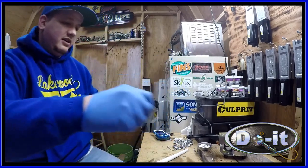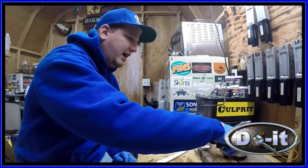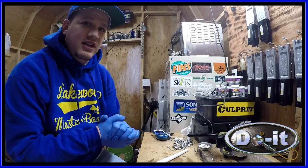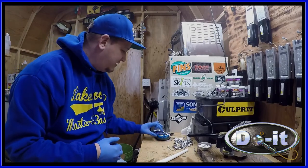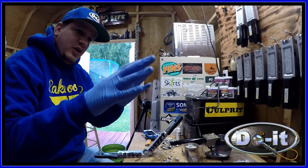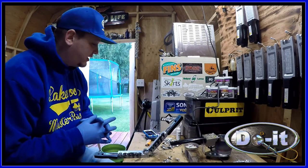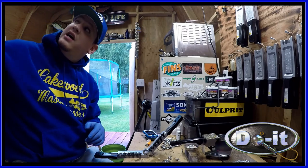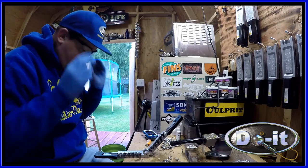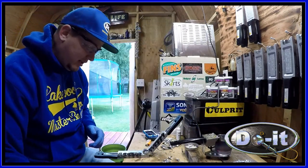All right. So then I keep the mold on the pot here because you want to make sure that the mold stays hot at all times. All right, let's do this. Okay, so we're ready to pour. If you notice, I have my gloves on. Whenever I'm touching lead, I always have my gloves on. I have the door open. I have a fan going on. Wear eye protection. And then when I'm pouring the lead, I'm gonna be wearing the welding gloves.